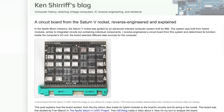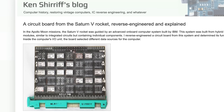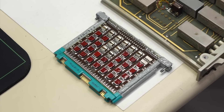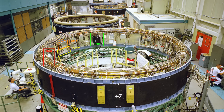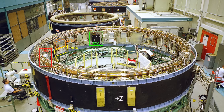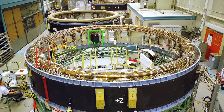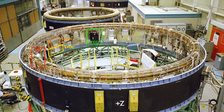Ken identified it as a capacitor decoupling board from the LVDA — the Launch Vehicle Data Adapter. The LVDC and the LVDA were the systems that controlled the Saturn V rocket, a different computer from the Apollo guidance computer. The LVDC was built by IBM using their own technology, and the LVDA was the data adapter with analog-to-digital converters feeding data into the LVDC.